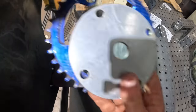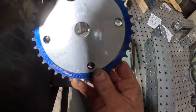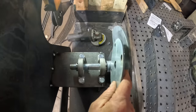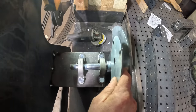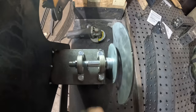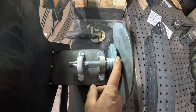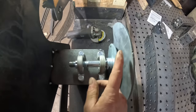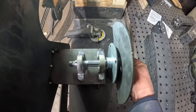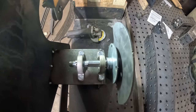I've made this inner plate for a cog I already had lying in the workshop, so I thought I might as well use it up. Those holes seem to line up alright. The idea is this plate goes in here with enough clearance for the chain. Now obviously there's no drive dog here — but I don't think we're worried about that, because if Jim gets stuck in any way it's just going to slip and save us a load of pain. If I put washers in here and dog that up, I can set it up as a drive clutch effectively, depending on how tight I do that nut.